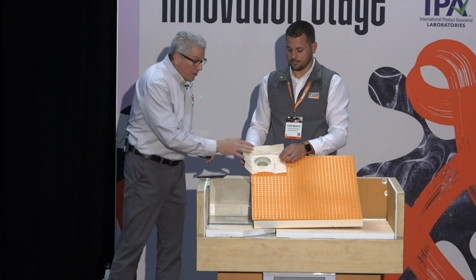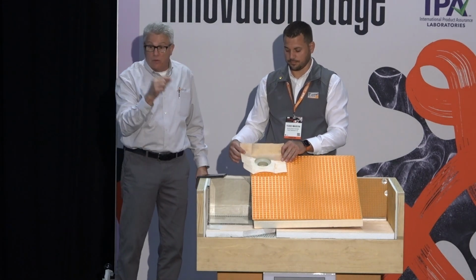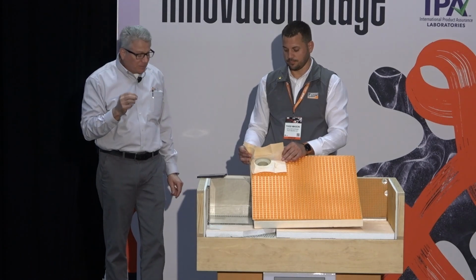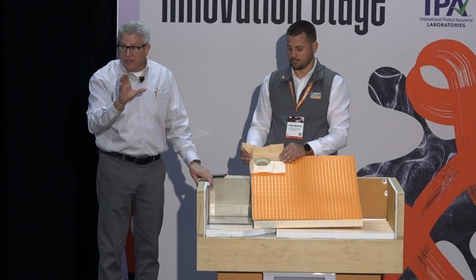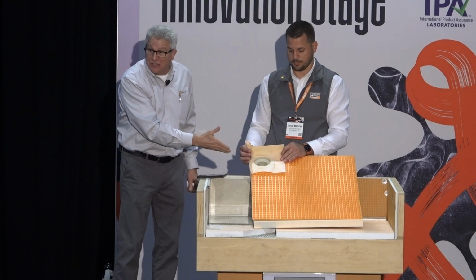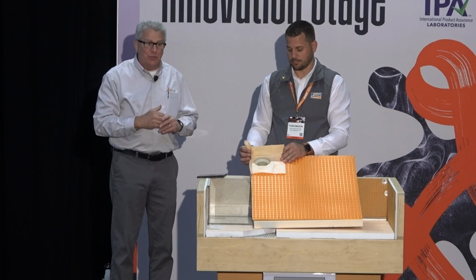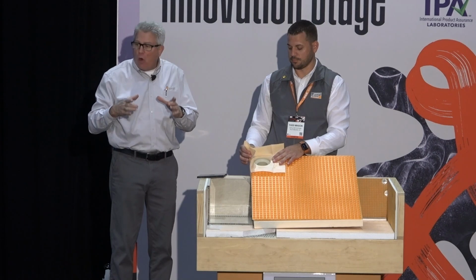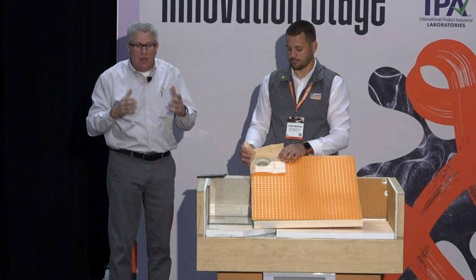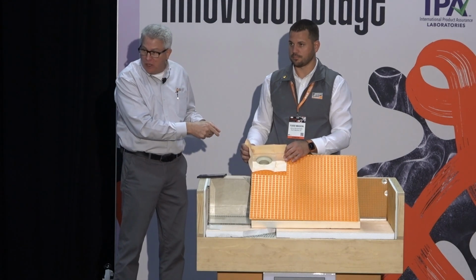But we wanted to show you a center placement or anywhere in the floor placement, but then this is another one where we really heard this from architects and engineers that said, the drain's really up against the wall somewhere, or maybe even an inside corner here, and your other flange is too big. Can we cut that flange? And we're like, we really don't want you to cut that flange because that's the bonding area for your waterproofing to tie into the drain. So let's not do that, but we have an alternative. This is the flexibility that you get out of this drain.